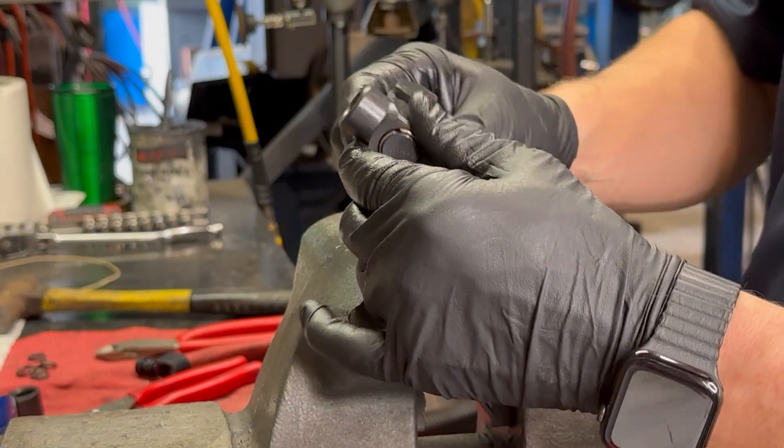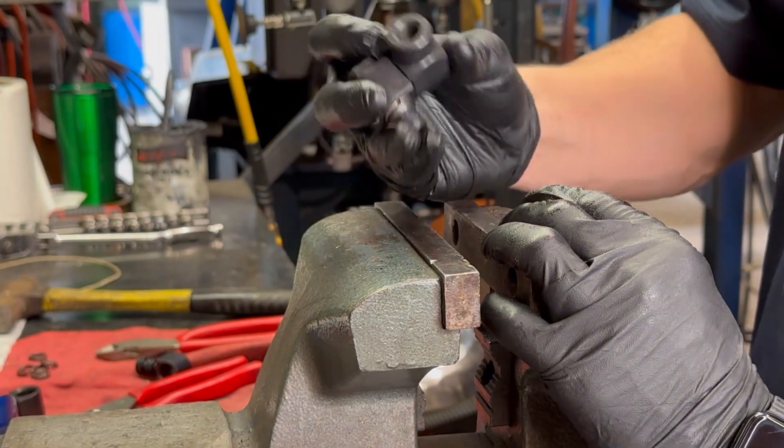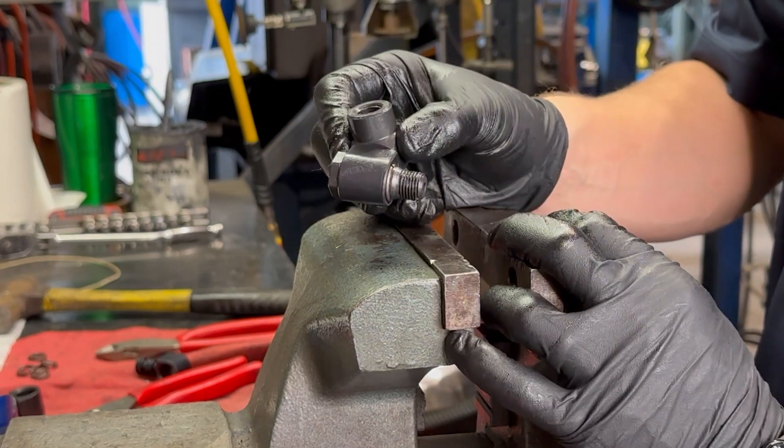These swivels have been disassembled, old swivels taken out, new swivels put in — ready to go. Put a quick connect on it, thread it on the tool and test it. So that is how to take apart the swivels, how to put them back together, how to change the seals, things to look for, and how to fight that spring clip. If you have a better idea on that spring clip, trust me, I am all ears. Thanks for watching. If there's anything else you guys would like to see, let us know in the comments on the website or email us at torklife.com. Have a great day.